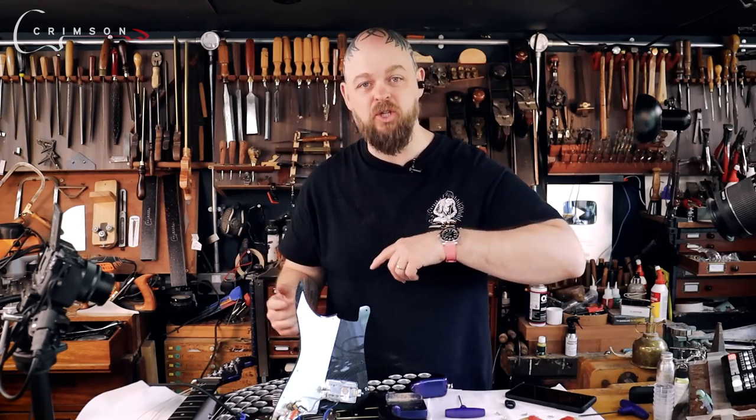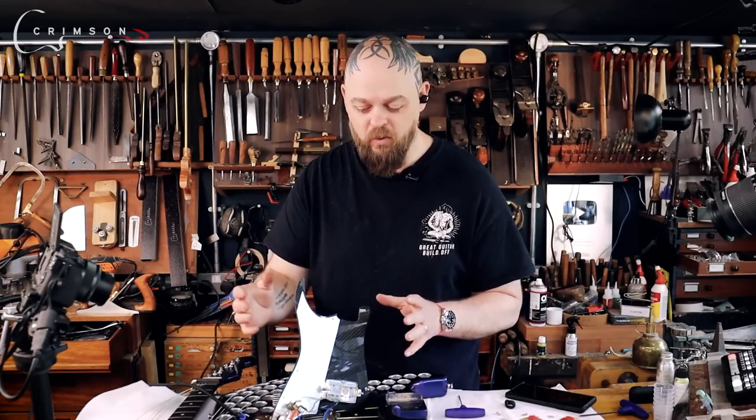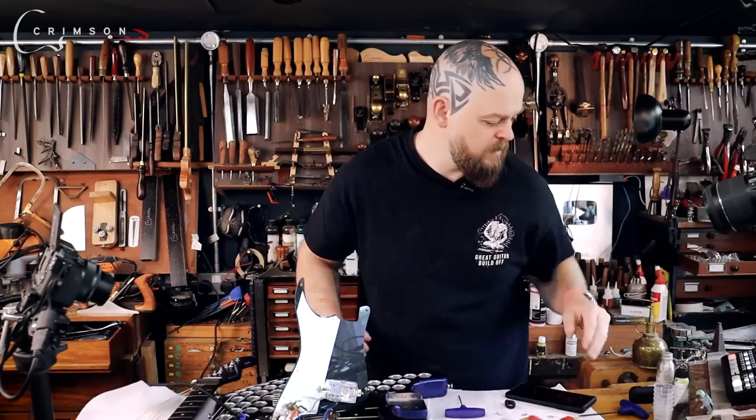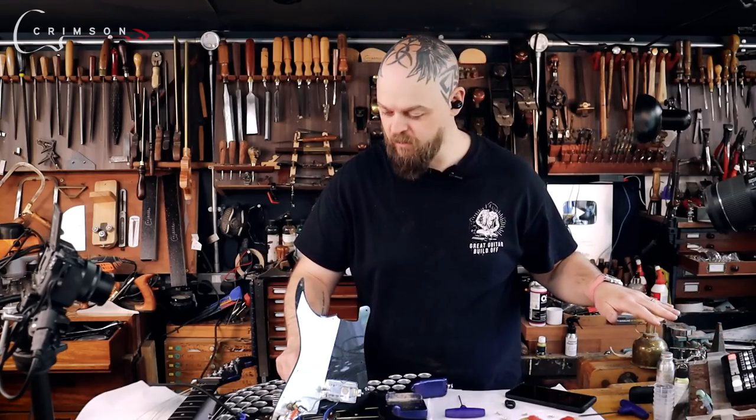The wiring looks ostensibly okay. Now, I haven't wired a ground to the shielding inside the cavity, which I've always thought wasn't important, but on talking to people who actually know what they're talking about, it's actually important. In the comments in the build video, people were saying, oh, your carbon fiber isn't really gonna act as a shield. I don't think that's really the case. Check this out. So we can hear an earth buzz. And when I touch the bridge, we've got more of it.